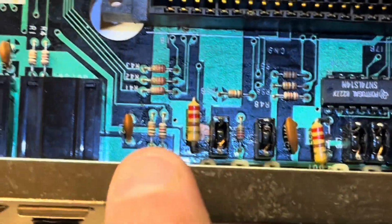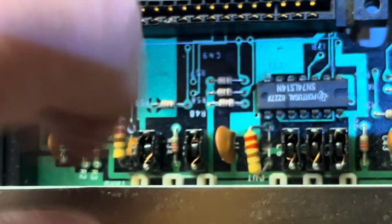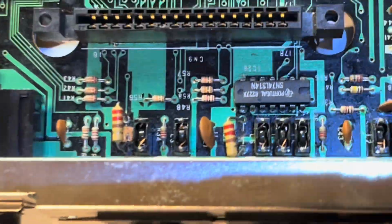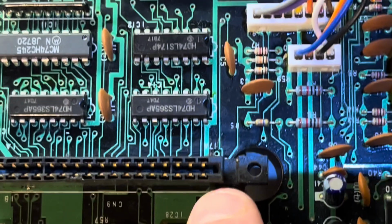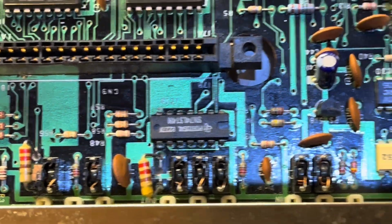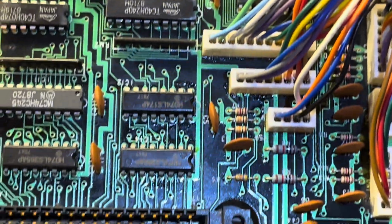And I think it was all part and parcel of what happened here. So it looks like there's a bit of circuit board missing where that resistor was replaced. The resistor that was flush on the surface, which was a correct 1/4 watt one, I guess, probably blew because of some electrical problem on MIDI, and that's quite common. It took that with it because that's been replaced, and may have just burnt out the track there, which shouldn't really do because it's after the optocoupler. Maybe they put a new optocoupler on there, I don't know. But yeah, that's moving in the right direction, I think.